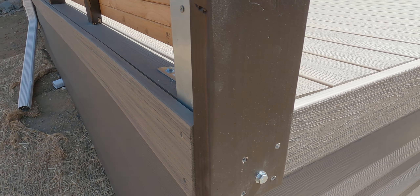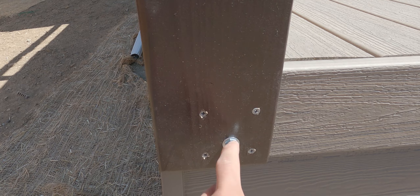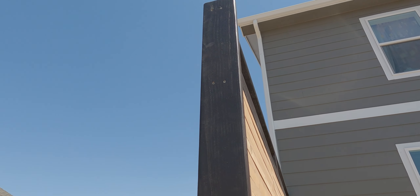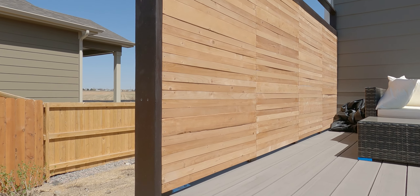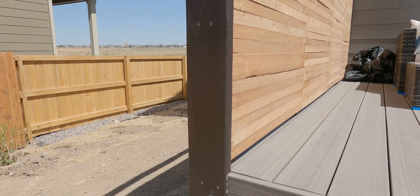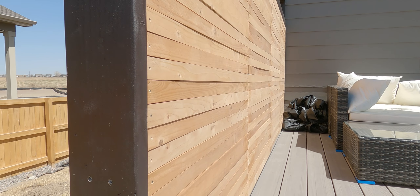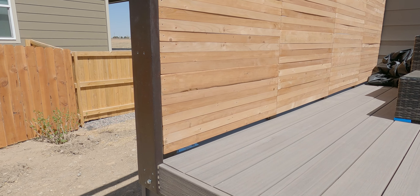There's also a metal strap that attaches to the post and to the side of the deck, giving it extra support. This was a last-minute decision — we added a 2x6 that attached to the 4x4 and to the side of the deck and to the wall. By adding this 2x6, it made the wall a lot more solid and structurally stronger. It can get very windy in this area where I live, so I just want to make sure this wall is as solid as possible with no movement. Once I put up my railing, it will attach to the side of the wall and give further strength and support, but I will show that in a different video.